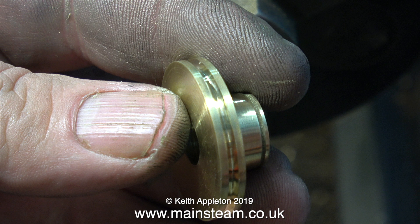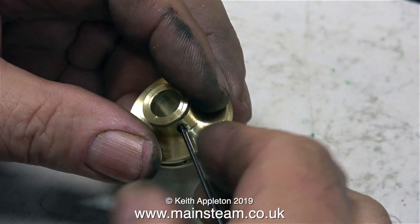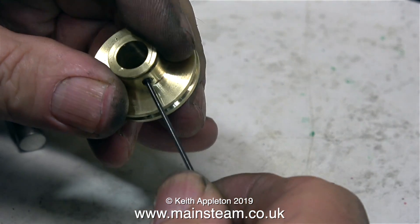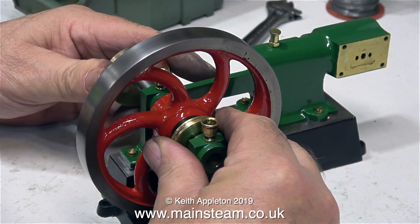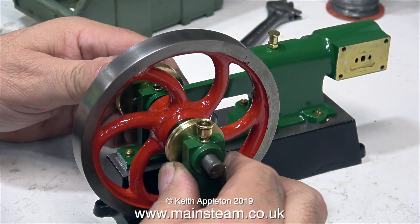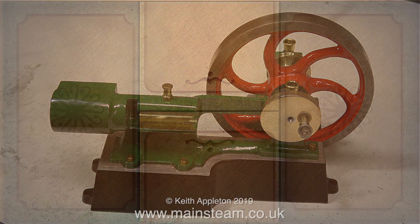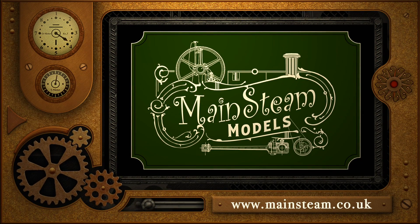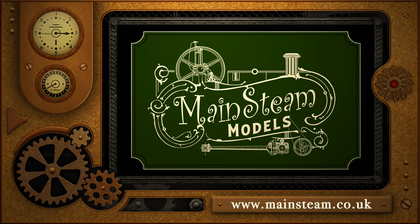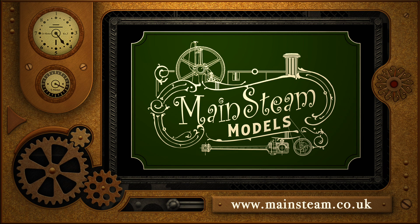Finally, I slacken the mandrel in the chuck and push it out of the pulley with the shank of a twist drill used the wrong way round in the tailstock chuck. The pulley doesn't look perfect but it's a lot better than it was. Time to fit something to clamp the pulley to the crankshaft — I'm not going to use a large ugly bolt; I'm using an allen-head grub screw. Now I can loosely reassemble the engine and it's going together beautifully. Theoretically this engine should run very well, but I've yet to find out. The engine's starting to look quite good — I still think I'm going to give the flywheel another coat of red paint. Thanks for watching and I hope you found it useful. Please visit my Mainstream Models website and click on the video playlists section to find other videos you may like.